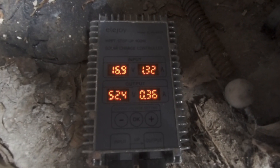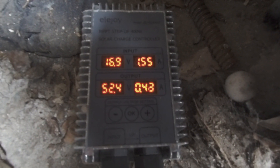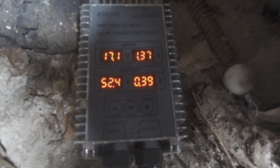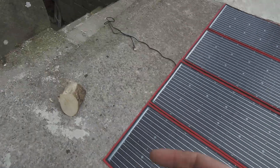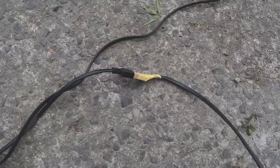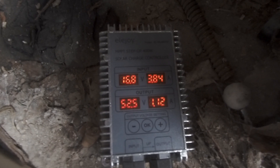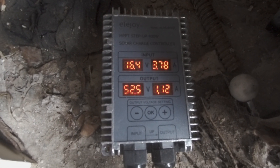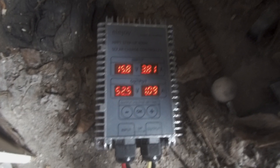Okay, so here is a comparison test. This is the 100W panel — we're only getting 1.4 to 1.5A, about half an amp in. Now switching back to the 300W panel with the same sun: we're getting about 3.5 to 4A and then about 1A in. So it's definitely making a difference.